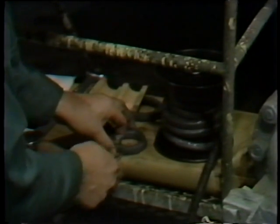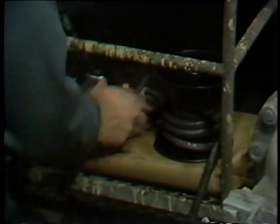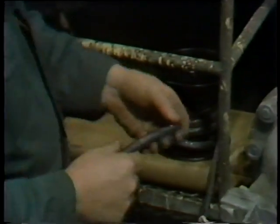It's important to emphasize the importance of cutting packing at the proper angle. With a ring of packing installed in the stuffing box, the two ends should butt tightly together so there's minimal leakage at that point. If the packing is cut improperly, a V-shaped or notch-shaped joint can result, causing excessive leak-off — not necessarily immediately, but if several rings are installed, it may seal initially and then leak prematurely.